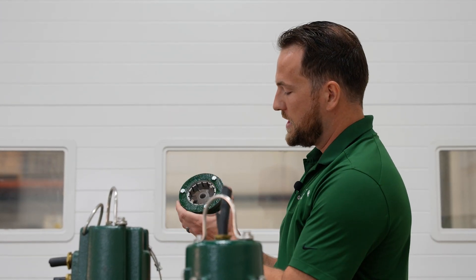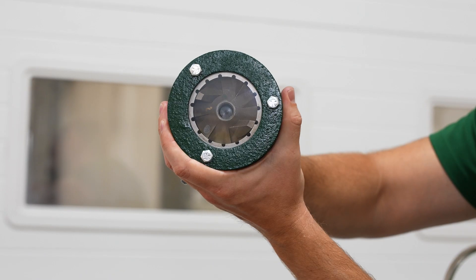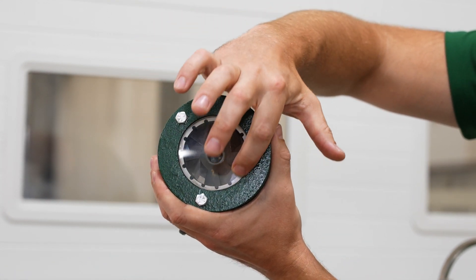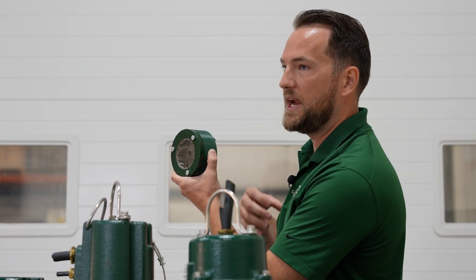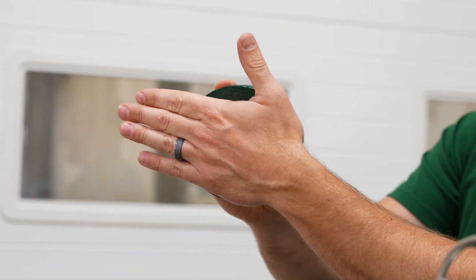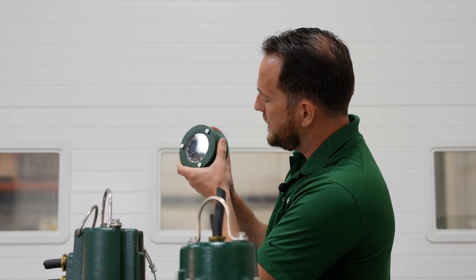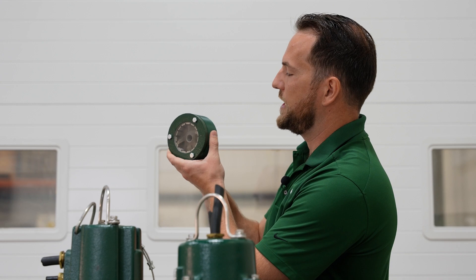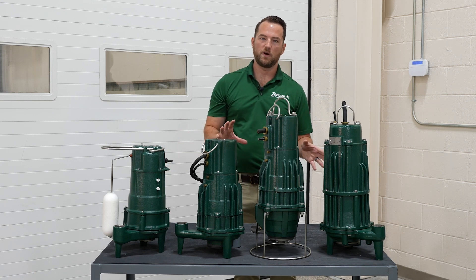Alternatively, a lot of our competition uses a radial cutting mechanism. With that design, you have a fixed cutter plate with a cutting mechanism inside that grinds against grooves as it rotates. The issue is those grooves slowly clog over time, reducing pumping efficiency and increasing the chance for clogs. It's also not constantly cleaning itself, so if a rag or material blinds off the cutting mechanism it can lead to a clog. These type of cutters also have more difficulty starting up after shutting off mid-grind. All of our pumps use the axial cutting type, which is preferred over radial cutting.